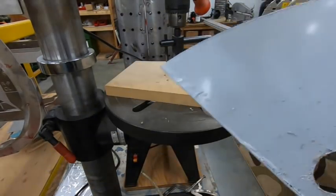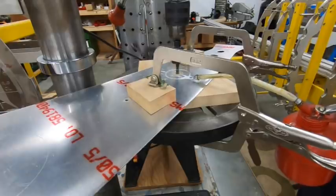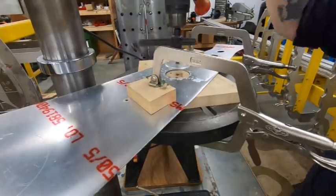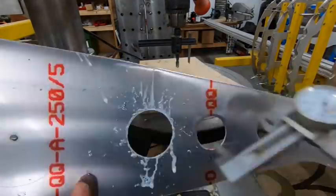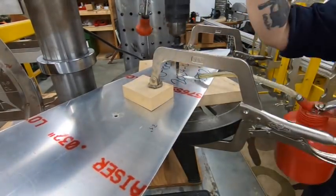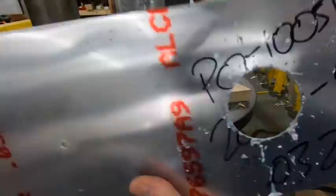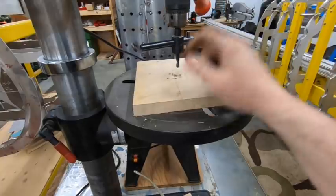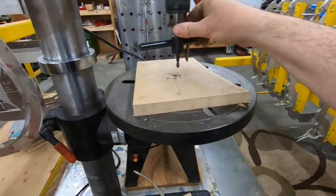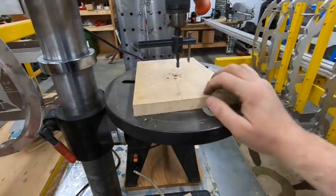We have two to cut on these ribs and then we'll move to the next size up. The next step is to basically go through the whole procedure again. I'll adjust this up — our next hole size for both ribs is 3.5 inches and then 4. I'll adjust it, do a test cut and make sure everything's dialed in, then cut both pieces, adjust again, and cut the next two holes.